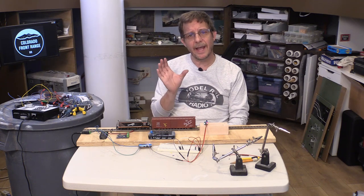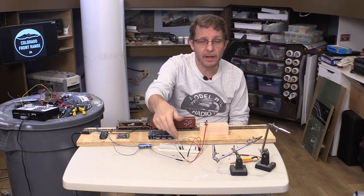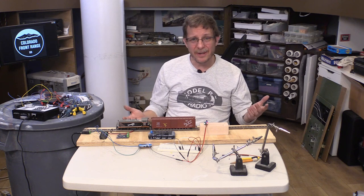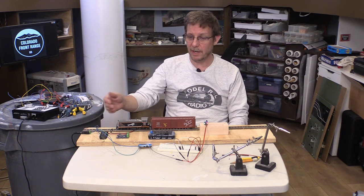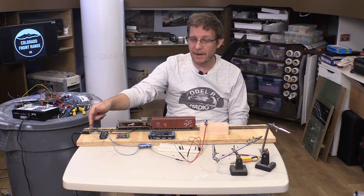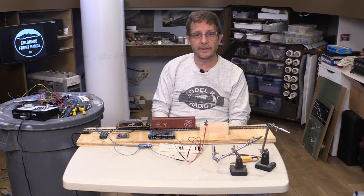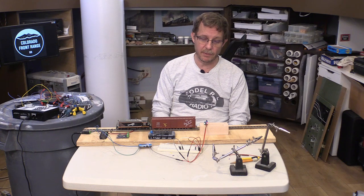I've got 8 of those relays on a panel all ready to just plug in the wire, just like I'm doing here. I paid 10 bucks for 8 of them, so that's a buck and a quarter apiece. So all said and done, you've got a power supply, which is a couple bucks, and a buckboard, or if you get a 5-volt supply then you don't need the buckboard. So 5 volts goes into the sensor, which then feeds back to the LED. And if you want to use relays, you can do that. It's a simple project, a couple bucks and you have a few detectors.